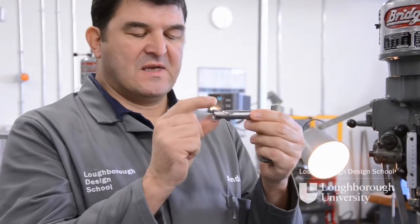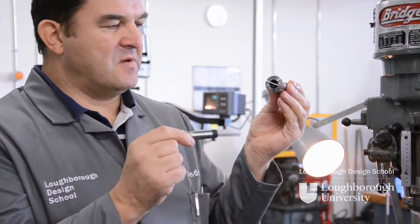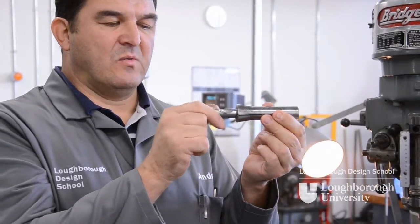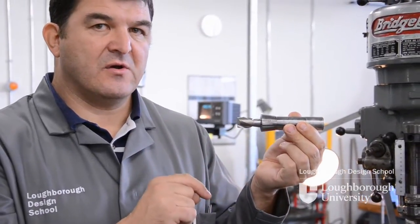The cutter that I'm using is a 20mm diameter cutter with the back of the cutter being a ground 16mm diameter, so I'm using a 16mm collet which slides in place — a nice easy fit. You must select the correct collet for the correct shanked cutter that you are going to use.